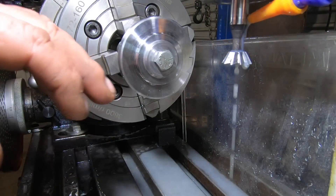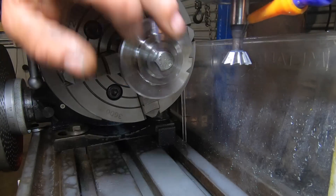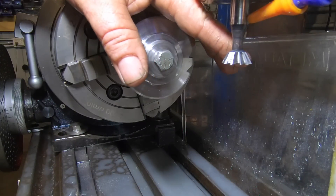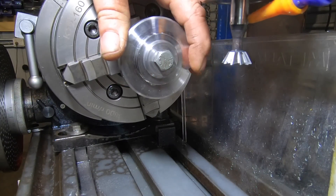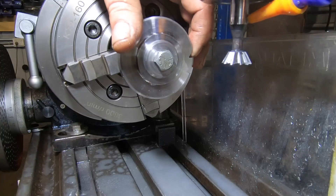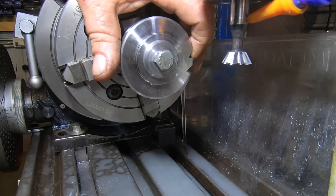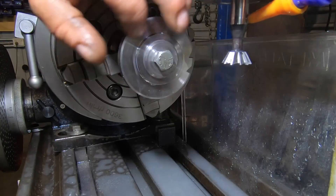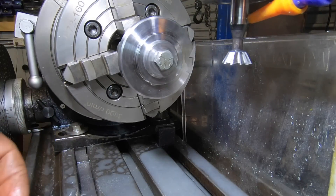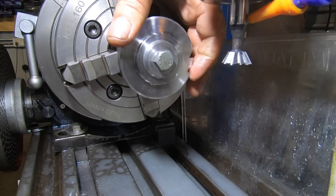You're probably all saying I've been a bit of a pushover — go a bit harder. But it's only a cheap import dovetail cutter, it wasn't an expensive one, and I just don't want to screw it because I haven't got another one. That's why I'm taking light cuts. So that's two done, and I'll get the rest of these done. I'll bring these back when I'm doing the setup for the second stage. It'll take a while, but I'm in no hurry.